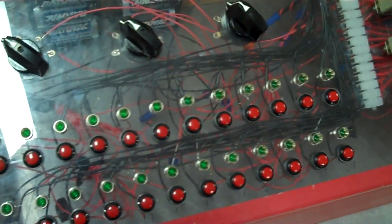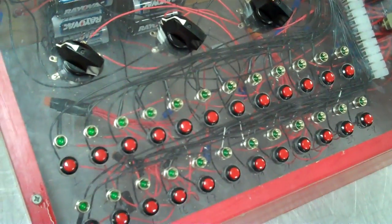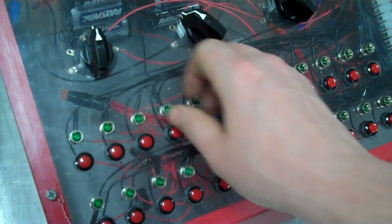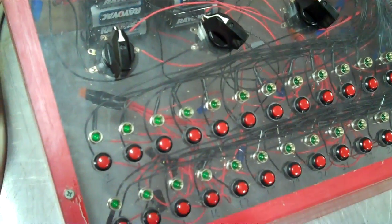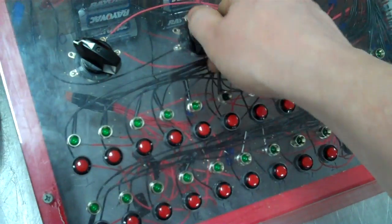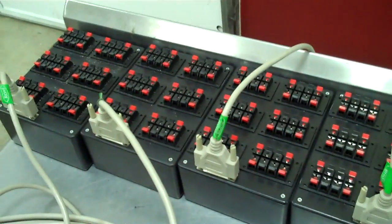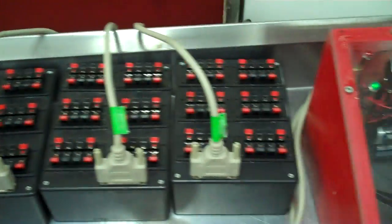As you can see, none of the LEDs are lit right now — I don't know if you can really see that where it's so bright in here. That's slat one, there's still nothing lit. Two, three, four, five, and six — I don't have anything. I'm going to put some jumper wires in a few of the slats so you can see how the continuity test works.